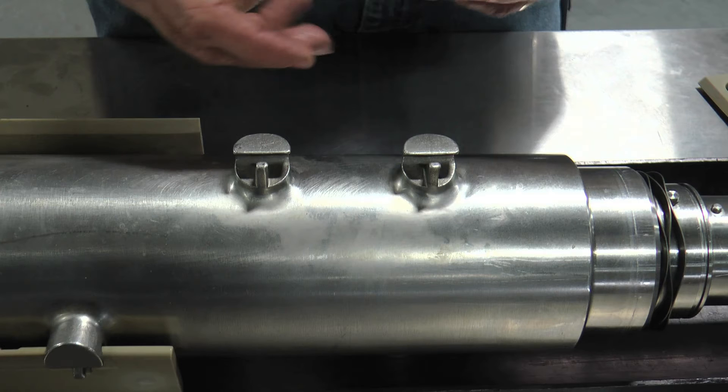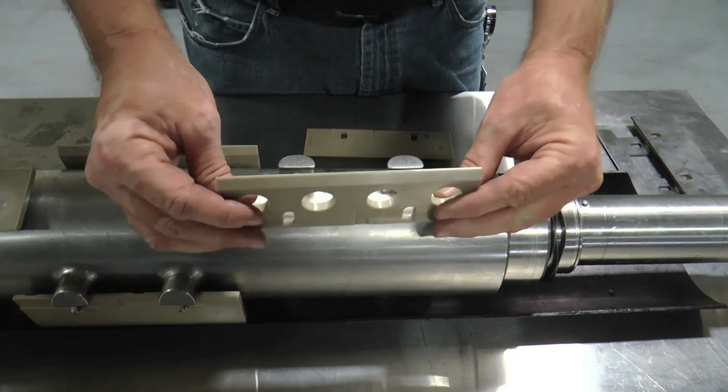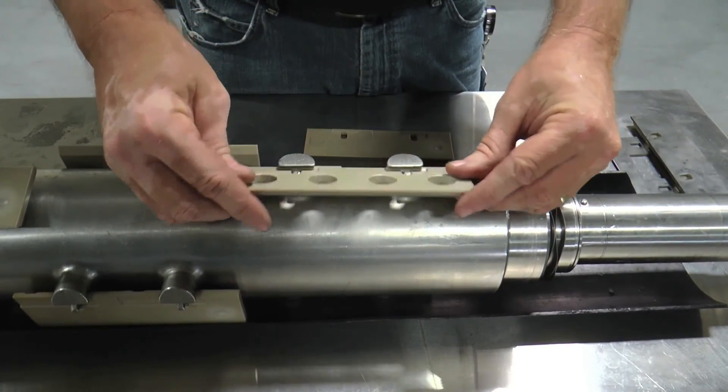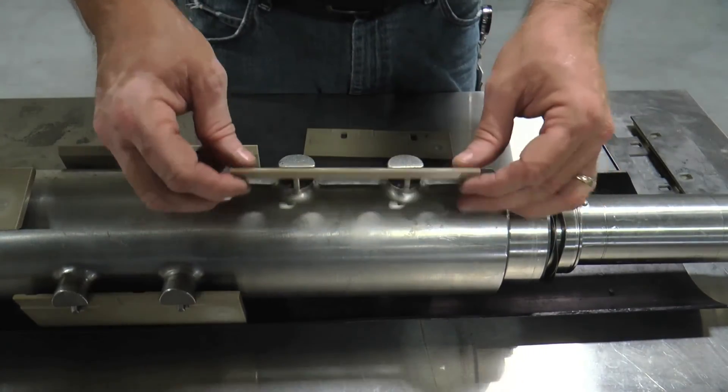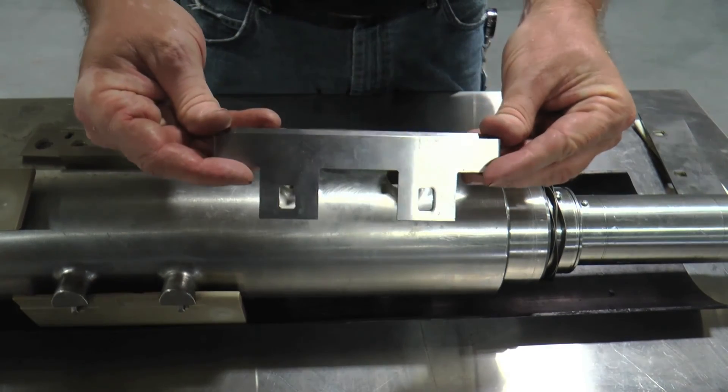Abrasions to the top of the blade pins could indicate contact with the tube wall, so there may be adjacent tube damage as well and may indicate the shaft is bent. Irregular shape or roundness to the blade pin slot indicates the blade tip pressures at the wall are high, thus exerting excessive forces through the blade and into the blade pin slot. Preventative measures on the process side should be addressed to minimize tip pressures. A relieved blade with holes is often used for viscous product that would otherwise result in high amperage conditions with a closed style. The series of holes allows the product to flow through the blade, but still maintains its scraping action with reduced power requirements.